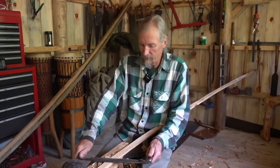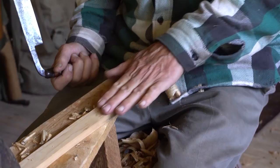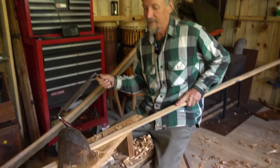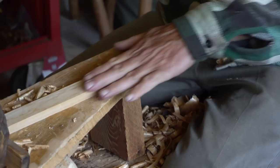I like to split a 20-foot 2x2 out of such a trunk — that's the tusk of the elephant that you carry home. I have a stash of such splits up in the woods and just go up there and bring them down when I need them because the big tree will give you quite a few. If you're a woodwright, this is what you've got to have. If you don't have really good wood then you can't split it, which means you've got to put it through a machine, which means you're not a woodwright anymore.